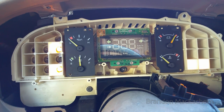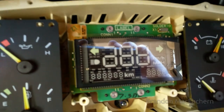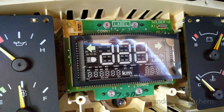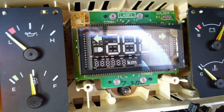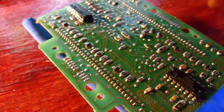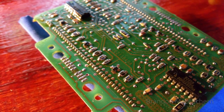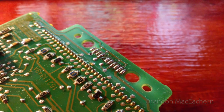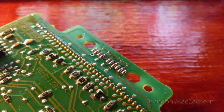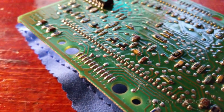Maybe there are just more cracked solder joints somewhere. But it's got that sealant on it - you can't exactly do much with it, because you can't actually get to the solder. So this whole module might just need to be replaced. That's a shame. Since cleaning wasn't working, we're going to go ahead and reflow the solder for all these pads to get rid of those little divots in them, and see if maybe that'll work. I did what I could, including this side - this side ended up being a little bit more messy. But we're going to use some rubbing alcohol once again just to clean up the pads and get off the rosin flux. Hopefully this works.